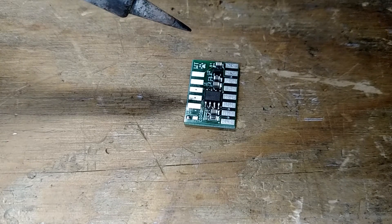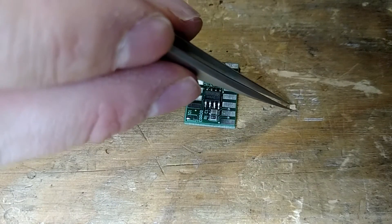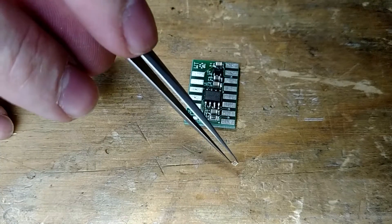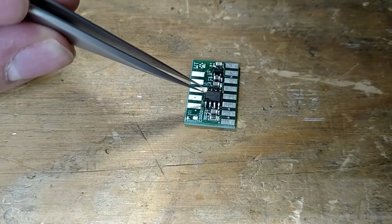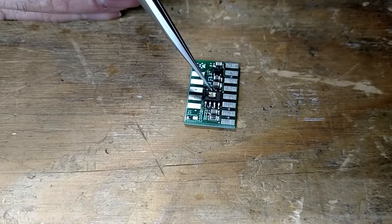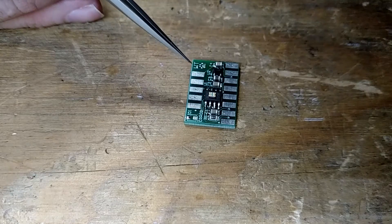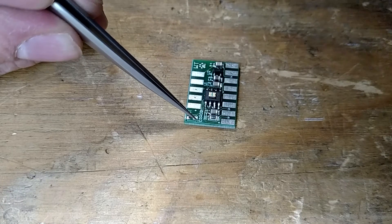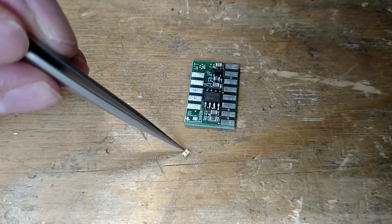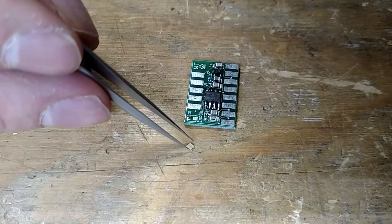Last but not least is the LED. Now this is a little tricky because it's not got a marking on the top — it's underneath, and that becomes a little issue. You can see that little tiny green line, and there's a nib that sticks out to one side — a little tiny thing on there — that's pin 1. You can see right here the pin 1 is that dot. So we need to flip this around this way and make sure that we don't reverse it when we put it down.